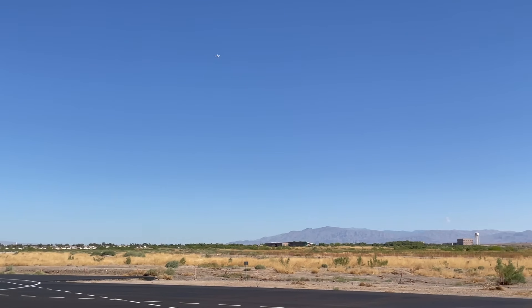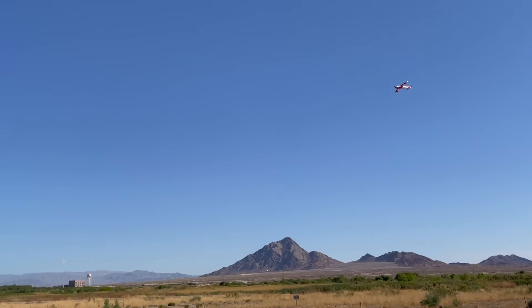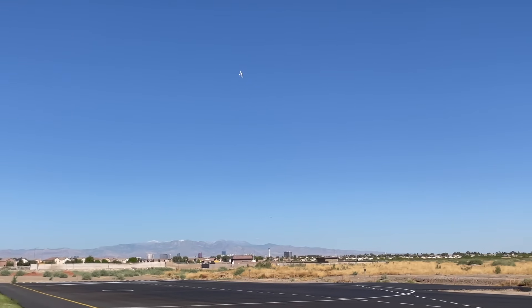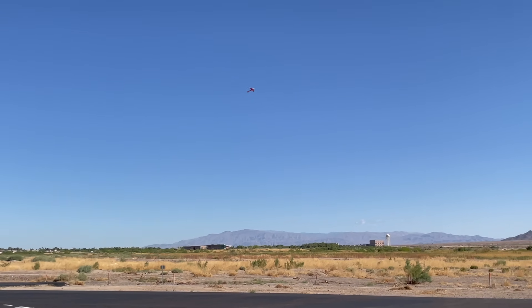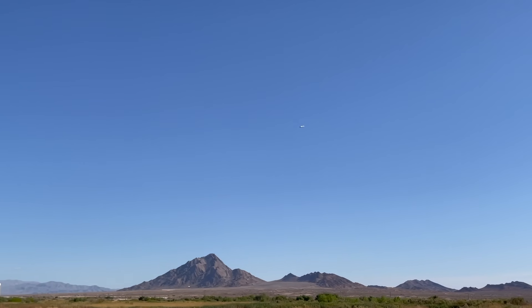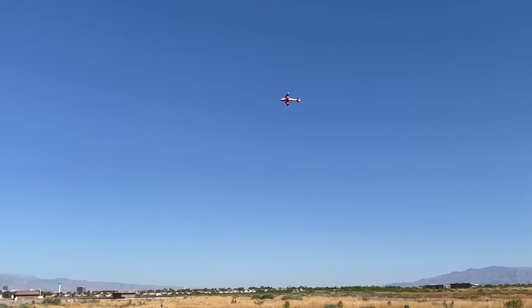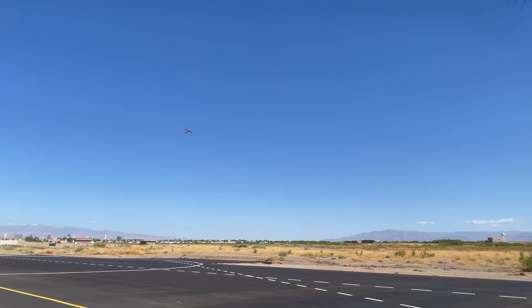This flight is actually the second flight of the plane. The first flight was on a 3-cell 2700mAh battery and flew okay, but with this motor and propeller setup it flew much better on 4-cell — giving about 3050 grams of thrust. It flew way better, with much more performance. Flying around at about 50% power, I could give it full power to do some cool aerobatics. This plane has a wide range of motors you can set up in it.